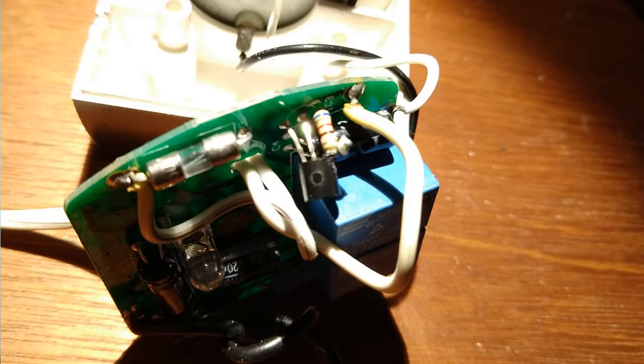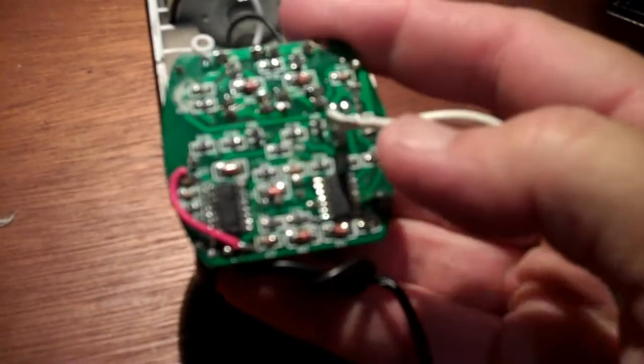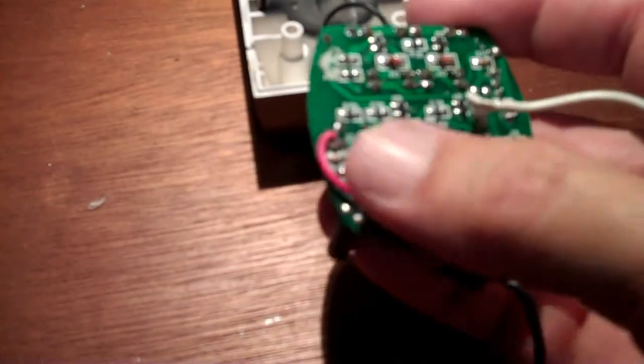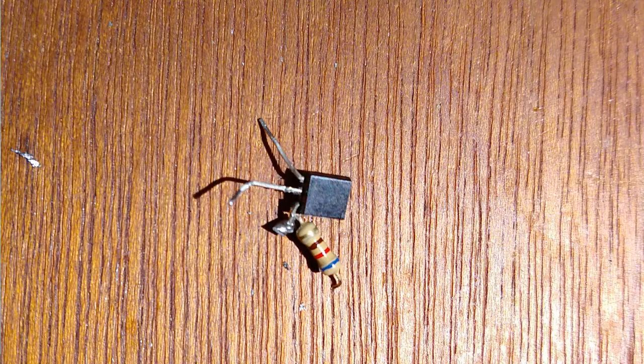Eventually I looked at this power regulator. The blind has a 12-volt power input, the motor is 12 volts, and the relays switch and run 12 volts, but the actual electronics use a 5-volt supply. This 5-volt supply had something weird with it. In addition to the board having a red rework wire — where either a trace was left off the PCB intentionally or it just didn't work correctly — they also had this resistor in place of the leg of this power regulator, limiting the input voltage and current into it.